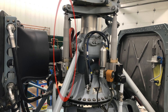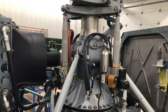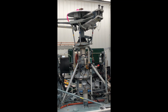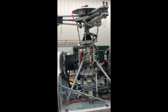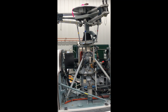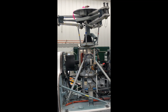On larger helicopters you need hydraulics to move the flight controls because they take so much power to move them. The servos are basically like power steering on your car — the flight controls make small inputs and the servos amplify that power, using hydraulics to move the swash plate and the tail rotor pitch linkages, making it very easy to fly the aircraft.